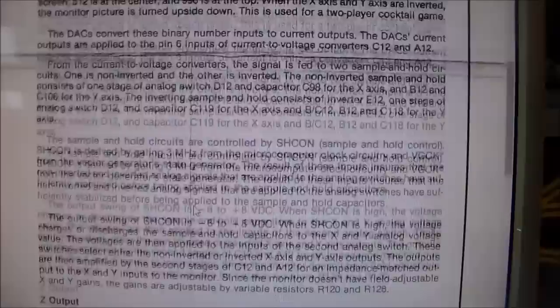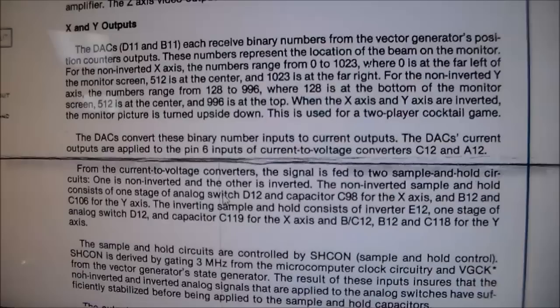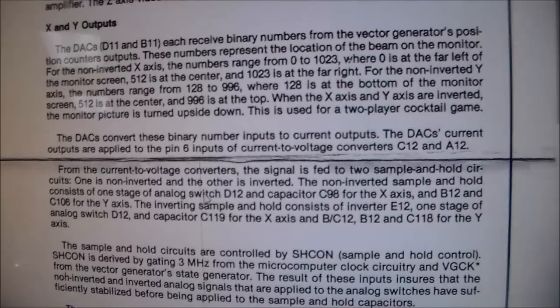So I started looking at it again, and I remembered one that I had worked on several years ago where the screen, everything is shifted to the left. And you can adjust that on the monitor, but usually people don't go and screw around with the tube. There's a ring on the tube to adjust the centering. And usually people don't go mess with that. A lot of people don't even know it's there. So usually if it's shifted like that, there's something wrong with the board.